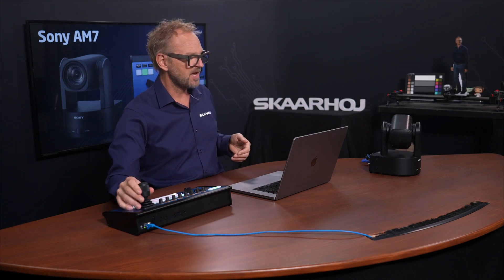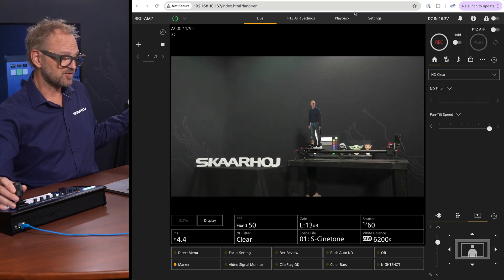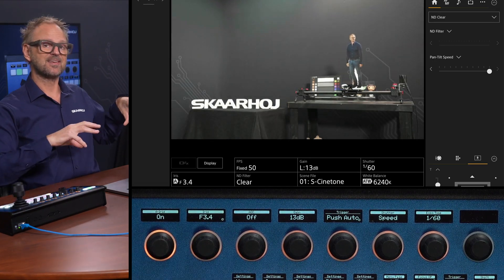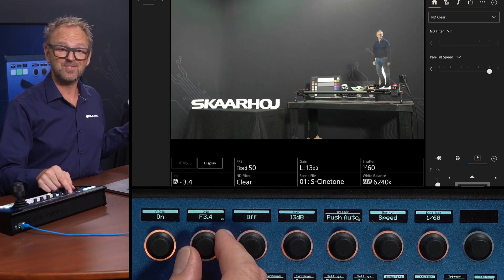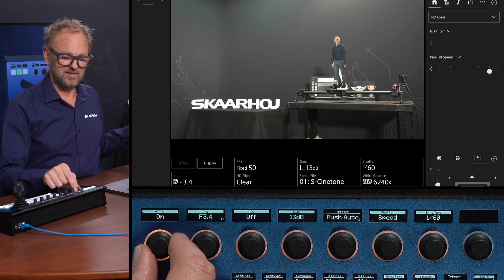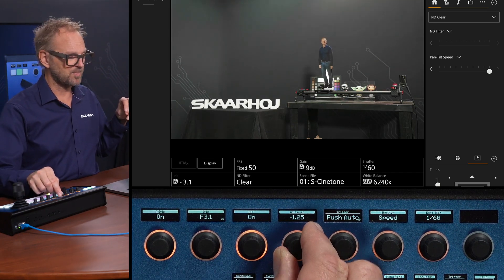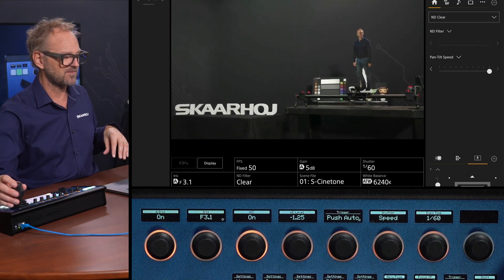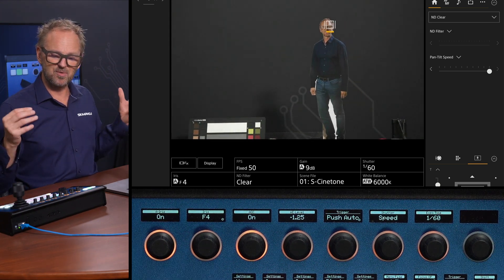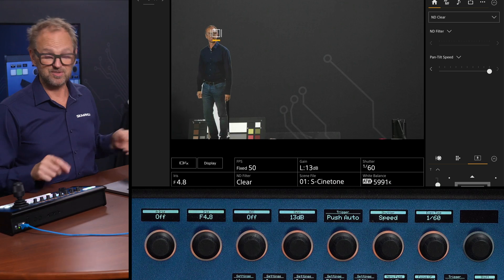Let's try it out in real life. I can move the camera around and position it to my setup using manual joystick control. If I turn on auto iris, the light intake is now automatically adjusted, and the iris knob becomes blocked out because it's automatically controlled. Turning on automatic gain control lets me adjust the level of gain applied — for a slightly darker image against this dark background I can tone the image down a little. Now I turn it off and go back to normal iris.